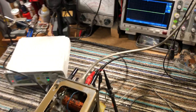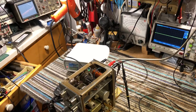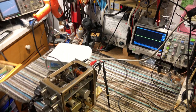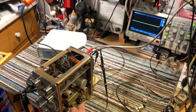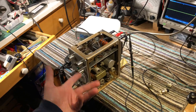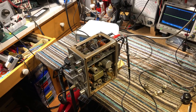Including the output tube, which is a 2E26 — I think that's a VHF tetrode, specified up to maybe 15 watts at most. It's giving about 12 watts on CW and about 10 watts on AM. It's a little bit lower on AM because the HT is also feeding the other tubes on AM, which reduces the available HT current, so it's struggling a little bit on the power supply it's got. There's not much chirp on the CW signal either, so I think it's pretty good now.